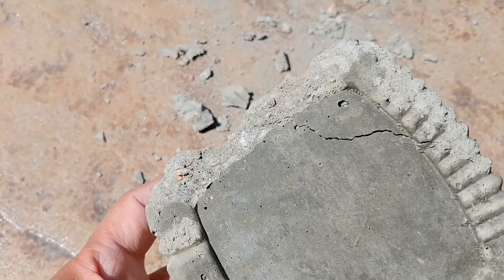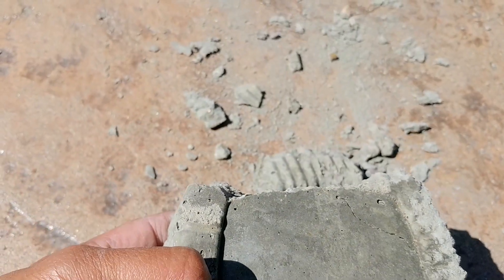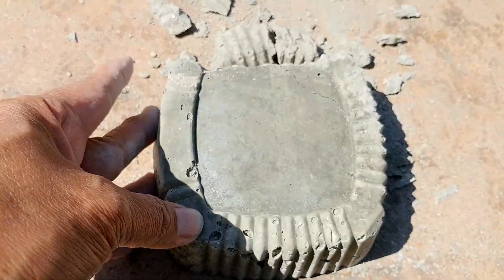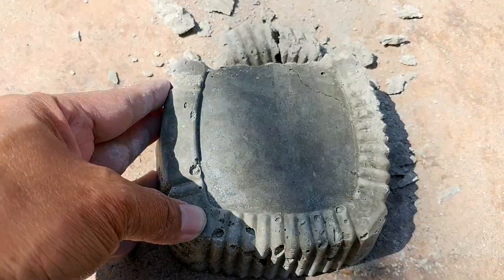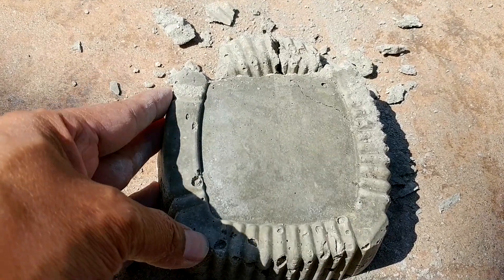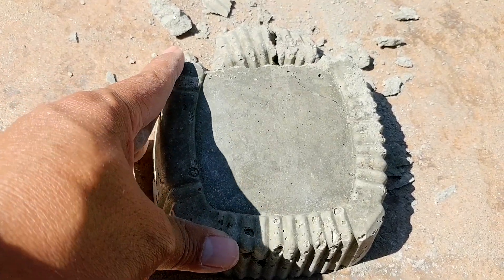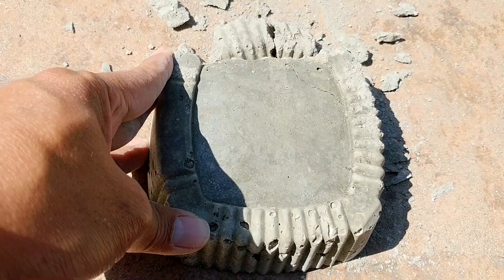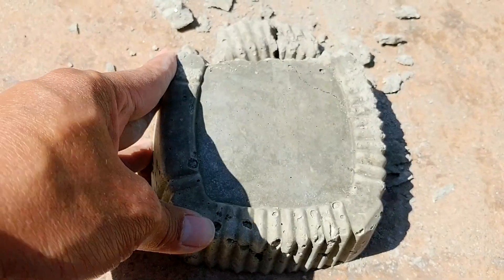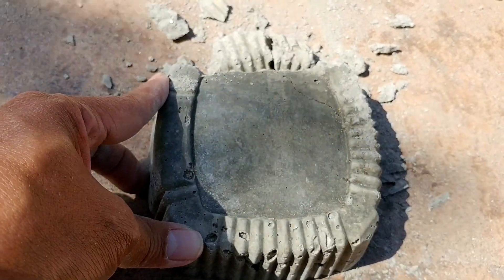The wet poured concrete set up better — it did crack on the sides and there are some cracks, but it was able to hold the weight of the van. We understand that dry poured concrete will take longer to cure. We'll do the test again in seven days and then another in 28 days. For now I'll continue watering both concretes so they can absorb more water. Make sure to click the subscribe button so you get notified when I upload that video — thanks for watching!